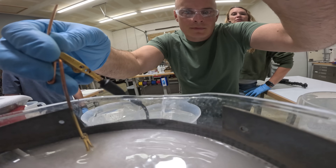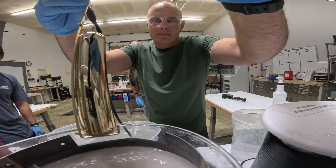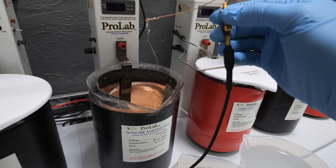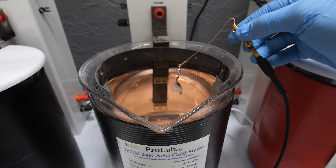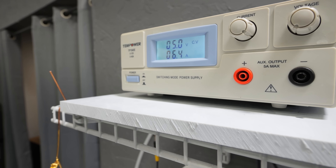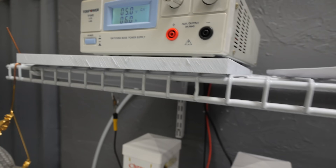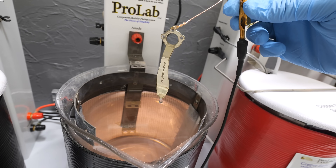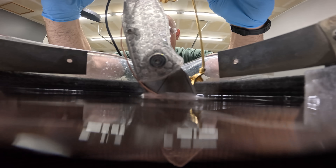One of the reasons why stainless steel is so stainless and durable is because it instantly forms a layer of protective silver-colored oxidation that doesn't allow any rust to penetrate the surface, like normal steel does. However, if we want this stainless to chemically bond with gold, we need this TriVal acid to etch the surface of the toothbrush, basically poking microscopic holes in that stainless oxide layer while 5 volts worth of electrical current fills the microscopically tiny holes with a thin layer of gold ions, which seals the surface, priming it for plating.